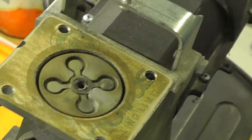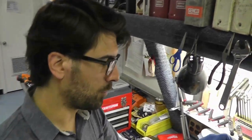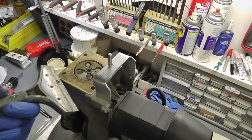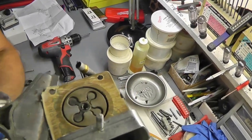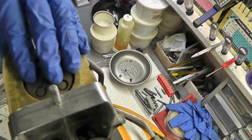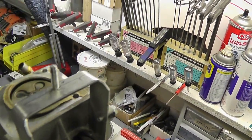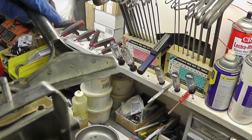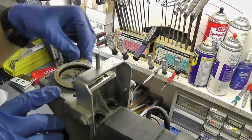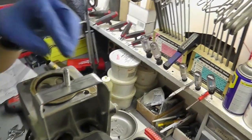We don't have to worry about damaging the old screw since we're replacing it. Once you have that removed, you'll see the old cylinder gasket on top of the base of the pump — it's adhered and won't come off by hand. Take a flat, broad scraper to remove the cylinder gasket. Then use fine-grade sandpaper or emery cloth to sand off the remaining gasket material from the base.